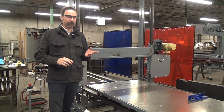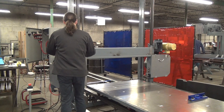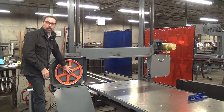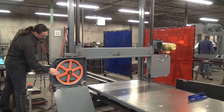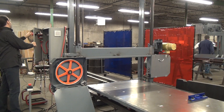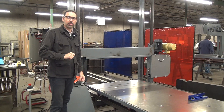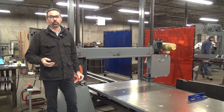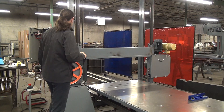The pneumatic tension gives us another couple of features. First off, we can very quickly change the blade. Here is the tensioning wheel — we'll reach around behind and detension the blade. It moves out of the way, the blade goes slack, you pick the old blade off, put the new blade on, re-tension the blade and you know the blade tension is set correctly. Contrast that with a screw-over-spring mechanism as is common on smaller saws. This is a much faster, more accurate way to do the job.